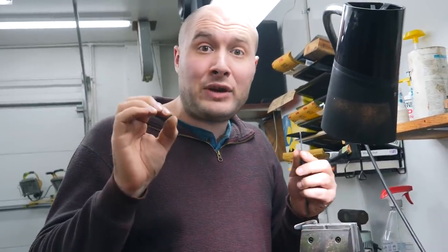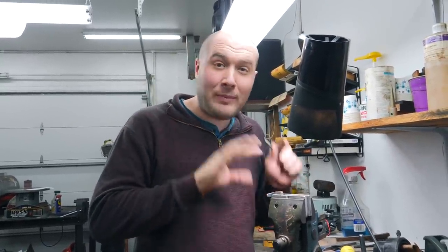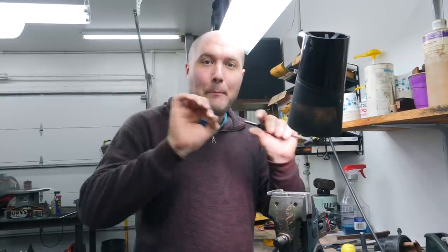The bluing is a gun bluing process that'll leave a nice durable finish on the fittings that'll protect them and it'll make them jet black, which is what I'm going for. It's going to be my black mirror finish. It'll make the gold inlay really stand out and pop.